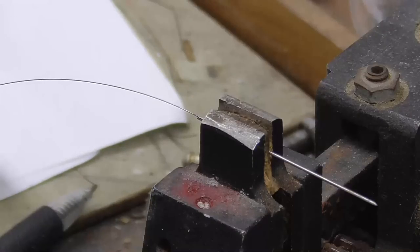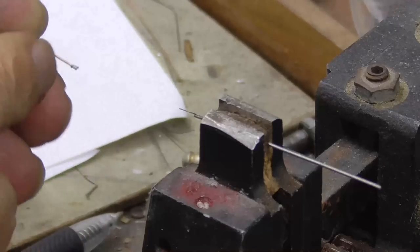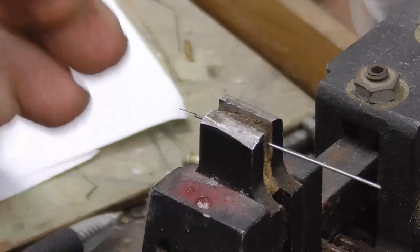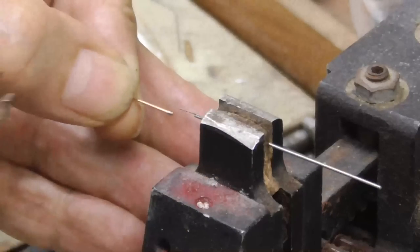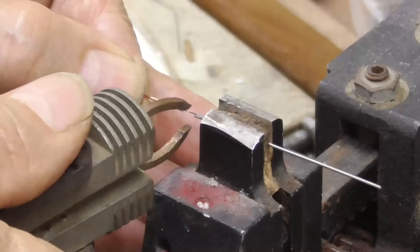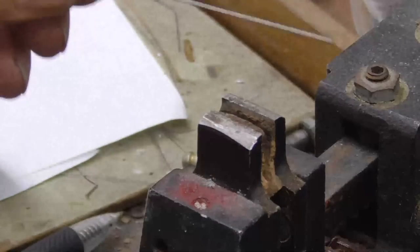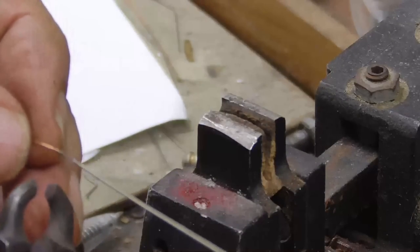To weld tungsten onto copper, we use a layer of nickel tubing. We take very thin nickel tubing and put it over the copper, and then we hit it with extremely high current, and the nickel goes ahead and melts the copper to being liquid, and it just sticks good to the tungsten. Trying to melt it directly, you never get it to stick. Got to have that nickel in there to serve as kind of a soldering material.